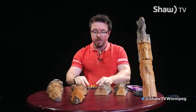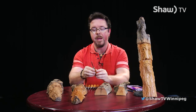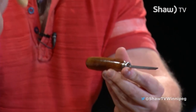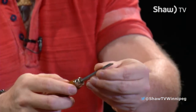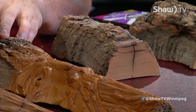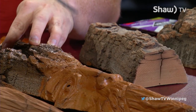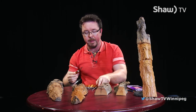I've got several different hand tools here, and one of the main tools you're going to use is something called a v-gouge. A v-gouge does a lot of the same type of stuff that the carving knife does, but it gives you a little bit more control. It does fine line work — it would be great for doing these deep grooves, lines under the eyes, and some of the eyebrow work on units like this.